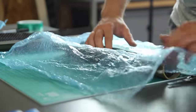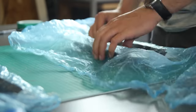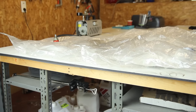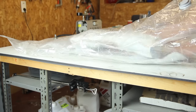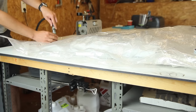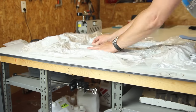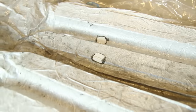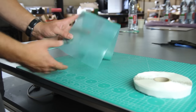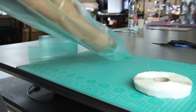This also helps gradually transition from one thickness to the other on the inside of the tube. Once all layers are placed, everything goes into the vacuum bag to debulk first. We use a breather and perforated film to remove trapped air between layers and compress them together. I apply the vacuum pump, position the bag evenly, and wait around 30 minutes for debulking.